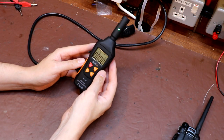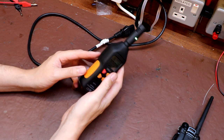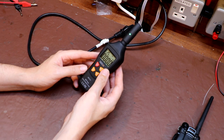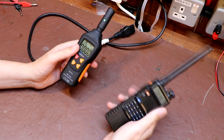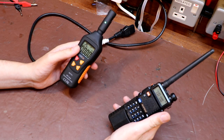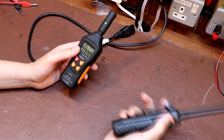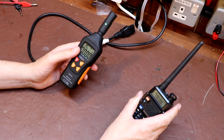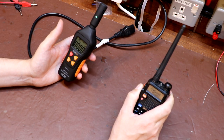So looking at the instructions that came with our EMF meter, it says that it should be sensitive to frequencies up to about 3,500 megahertz, which is pretty high. But I have been doing a little bit of testing with this handheld radio, and it's set to 145.600, and it's actually quite a powerful radio. This is set to produce about 4.5 watts at the moment. So if I just key that up, well,